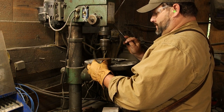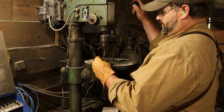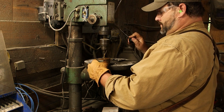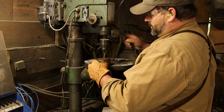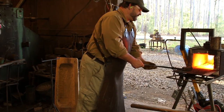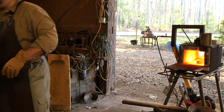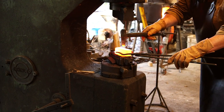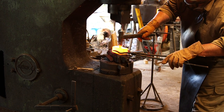Your hammer is going to be on film. We started originally making these hammers out of forklift tines, which is 4140 — we'd actually go get a forklift tine from the scrapyard — but cutting that into usable sections was just a pain. So the last batch we bought some inch-and-a-quarter square stock that was 1075, which is comparable to the 4140. Starting off, we have these hammer blanks at about two pounds.